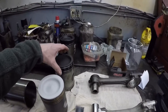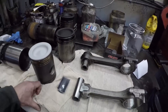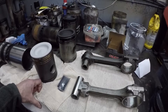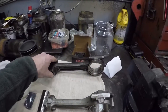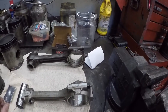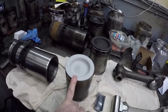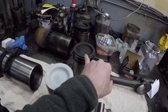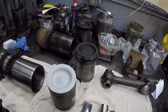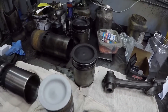The trunk piston is a one-piece piston. The pin, connecting rod, and your bearings. The crown on this one here is 18 to 1, and this one's 18.7 to 1. So different compression ratios.